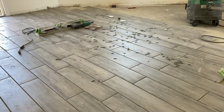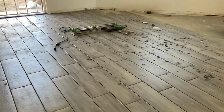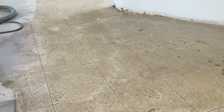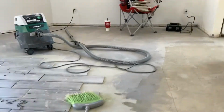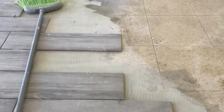All right, so here is day 2 of tile. It's going pretty well. This Eco Prime grip worked out really well. You can see there's no primer there. That's mopping and dirty stains. And then you can see where it starts to hit the primer. That primer is really gritty, so it creates a really good bonding surface.